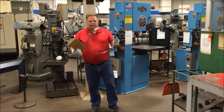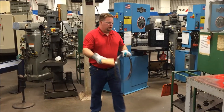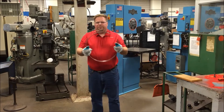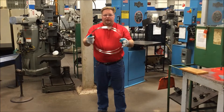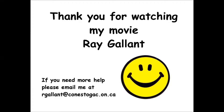After you have your blade into three nice neat rings, what you need to do is use two zip ties — two zip ties in case the first one breaks. There's a lot of kinetic stored energy inside a blade and it'll want to spring out, and it can be quite dangerous.